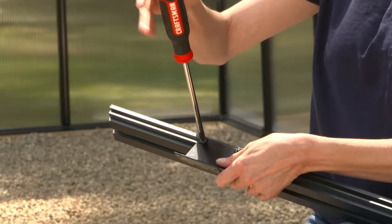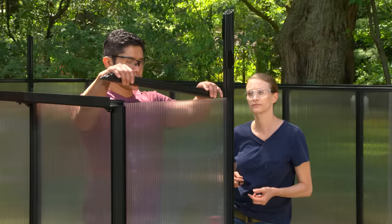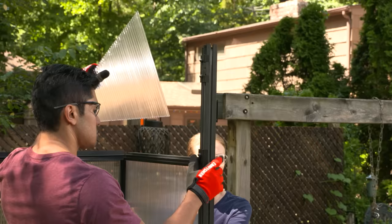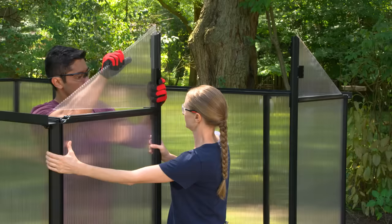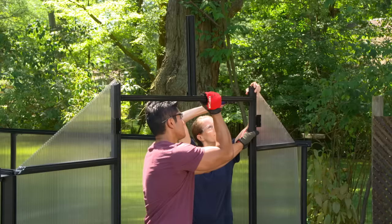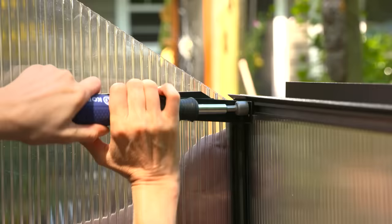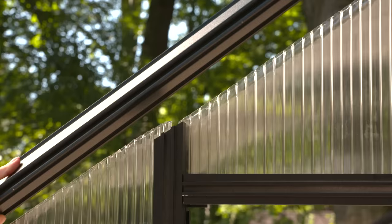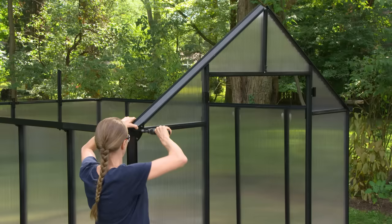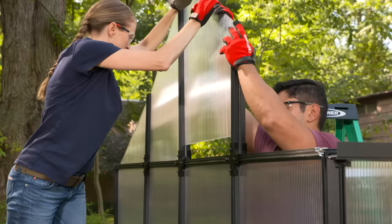On the front wall with the door, add your hinges to your frame — when you're done, they're going to be on the outside of the greenhouse. Then slide your framing members into position. Hold the door framing together by the horizontal piece at the top of the panel and secure it with the brackets and bolts. Set the angled panels in place. Now add the header piece and the barrel bolt lock. Then set the top panels in place and attach the corner brackets on the inside. You might have to trim the angled panels to make the framing fit on top. The gutters have a special bracket that covers the end and holds the corners of the structure together.